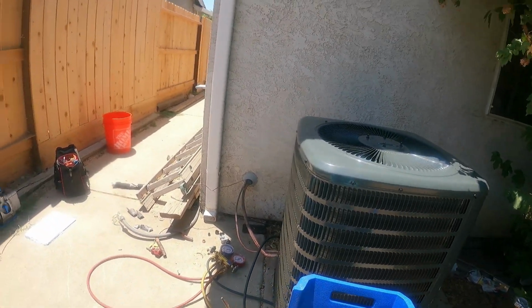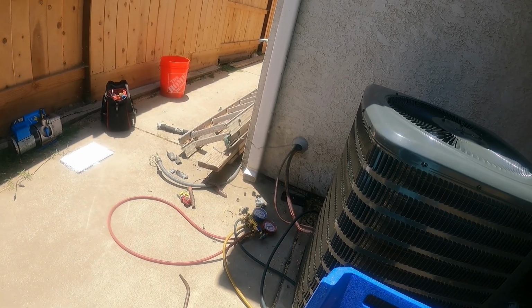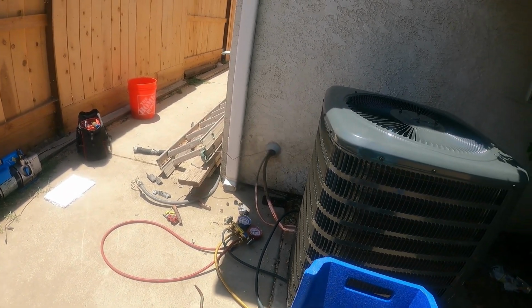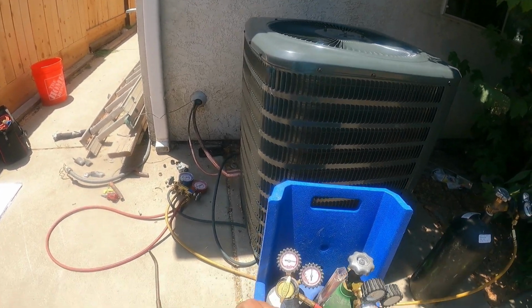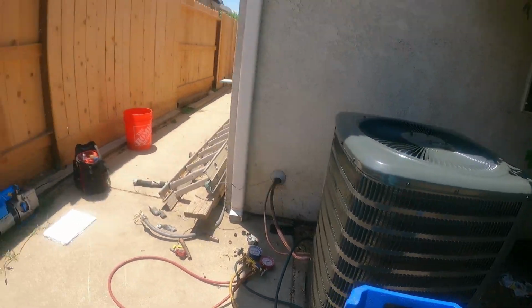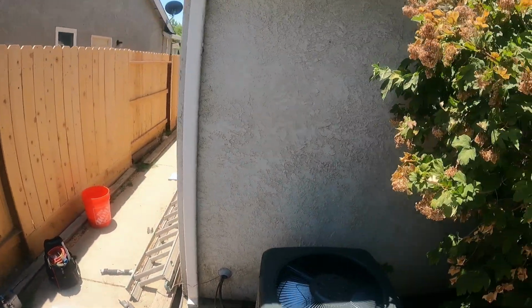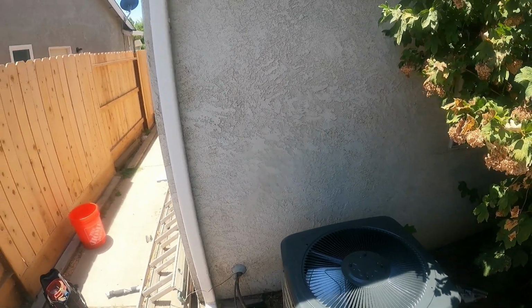There we go. Okay. And then you take your acetylene and you only want to crack it a little bit. All right, you don't want to open this thing full, and you like 5 to 7. See, we're at 10 right now, but watch when I use it. You see how it drops? And away we go. So we got nitrogen coursing through the system right now.